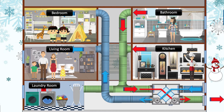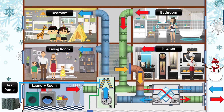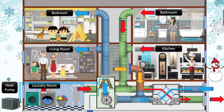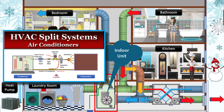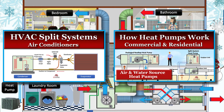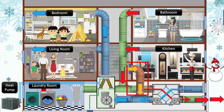This moves fresh air from clean areas through dirty areas. Heat recovery ventilator integrated with air conditioning system. This will require an outdoor unit and an indoor air handler. The indoor and outdoor units are connected with refrigerant piping. The heat recovery ventilator works the same way but is connected directly to the return air duct of the heat pump unit.